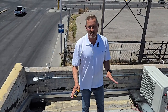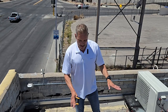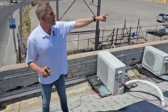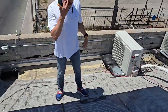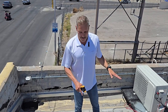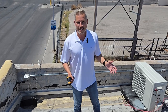There's less chance of wind getting underneath these, and that's one of the advantages of flexible panels installed this way. A lot of people say you need to put these on rails to give airflow between the roof and the panel — probably not a bad idea, but we want to make this super easy. We've had a couple installed for going on two years now and haven't had any issues. By having them right on the roof, there's no way air can get underneath.